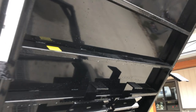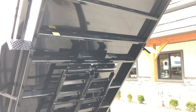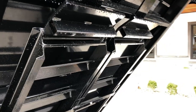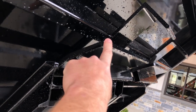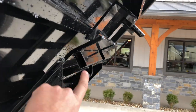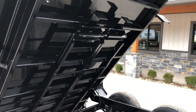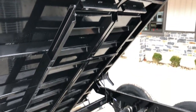Short Track upgrades to a 4-inch cross member on these. Telescopics are built a little differently than a scissor or single-piston; a single piston would be standard on this size dump and certainly all the hoist the average user needs. You'll also notice on the ramps a little heavier plating on the end — some manufacturers use quarter-inch plate, which over time will wear out and bend. Half-inch plate makes these very durable for the long haul. They also use a tube retainer to keep the ramp from kicking away from the trailer — the weight bears on the half-inch plate, but the tube keeps it from kicking out.